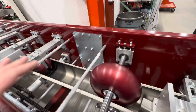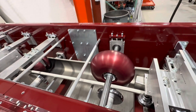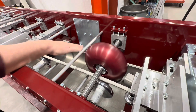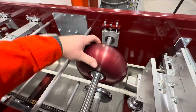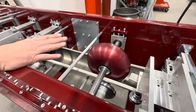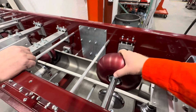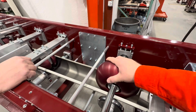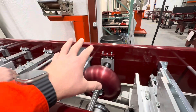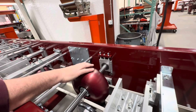If you go down too far you'll drive this roller into that roller and ruin them both. When the gutter is out you'll be able to spin it. This is about the correct pressure — that's our starting point. We very rarely stray from that unless it's a really hard steel. These rollers are solid, not hollow.